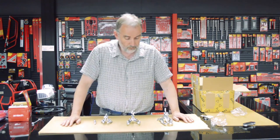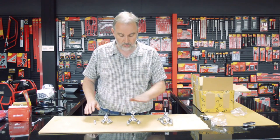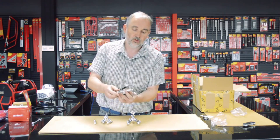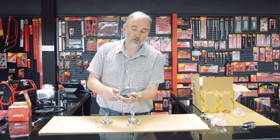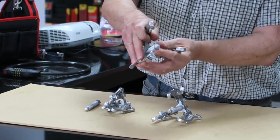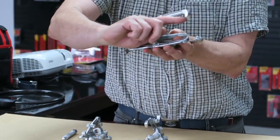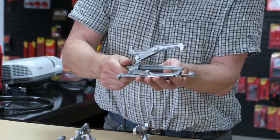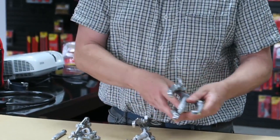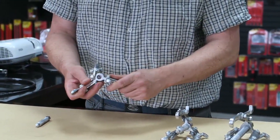Well Adrian, let me show you the three options — we've got the small, medium, and large sizes. For an outside gear or outside bearing, you adjust the three legs so they go over the bearing, grip with the legs, then tighten up the central bolt and that'll pull the bearing or gear off a shaft. Same with the middle one.